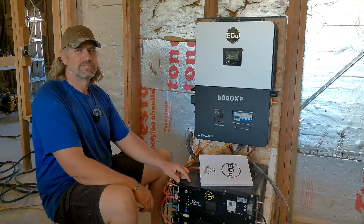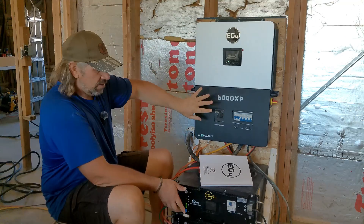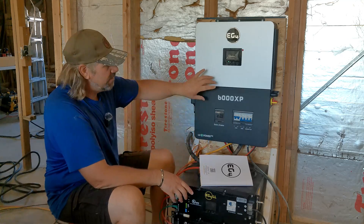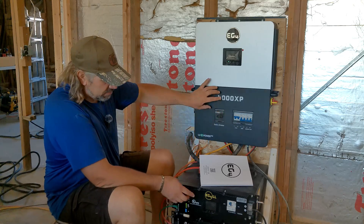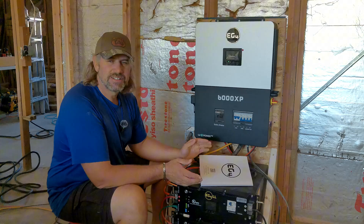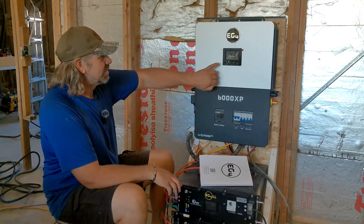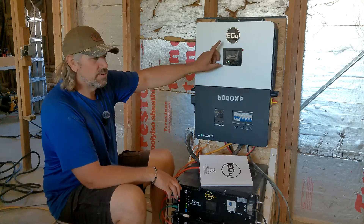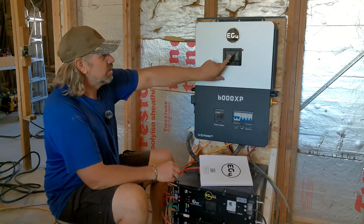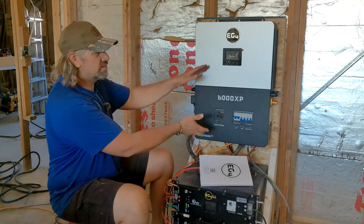Three days later — we're up and running like we should. Here's the thing: we did our install on Friday evening and as you saw, when it powered up we had nothing. I did a lot of research, YouTube and Googling, trying to figure out what was going on. I had DC power here but the inverter just was not coming on. The reason was there was no communication between the batteries and the inverter. I changed the settings to lead acid and we ran all weekend on that — everything ran just fine. But if you put it on lithium, all of a sudden everything shuts off because there's no communication between them. If you run as lead acid, there's power coming from here and it's going to run.